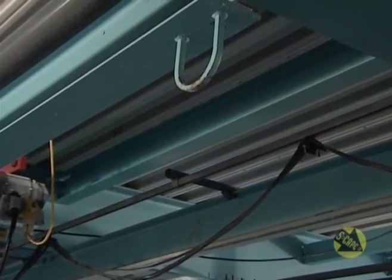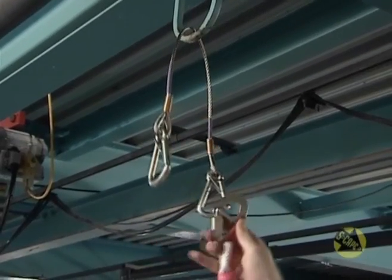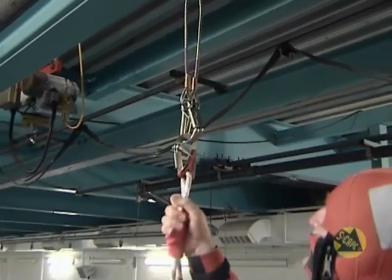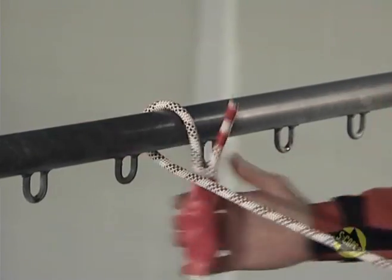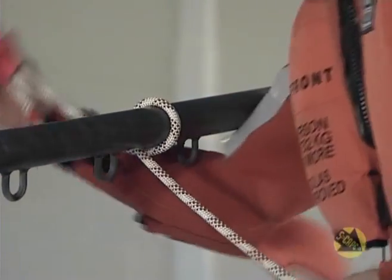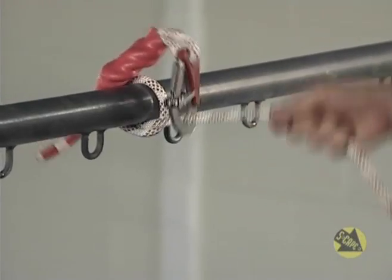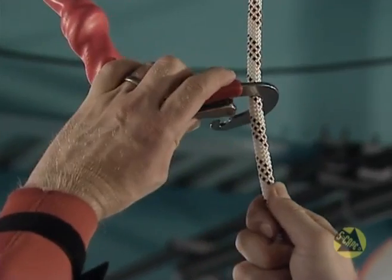You may also wrap the wire handrail attachment strop around the anchor point and attach the double action safety hook onto both connectors of the strop. If there is no point available above head height, use a substantial handrail. You should also check that there are no sharp or ragged edges below that may cause rope abrasion as you descend. Make sure the double action hook is secure.